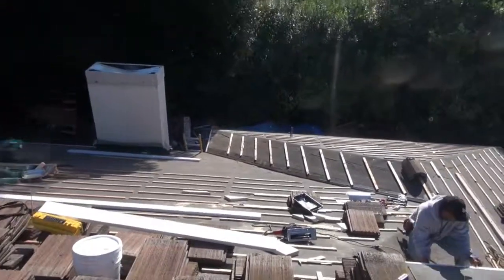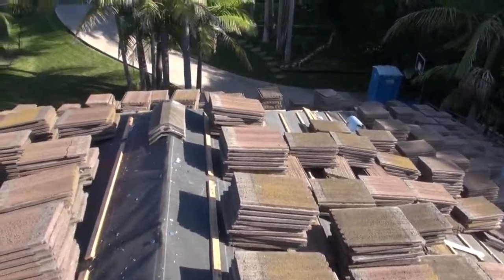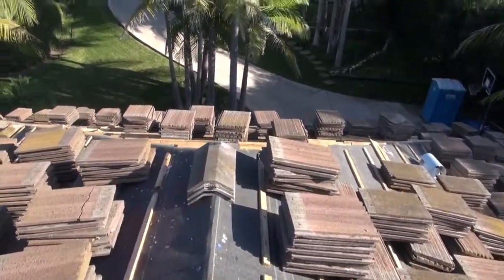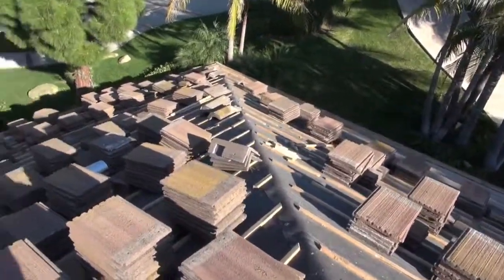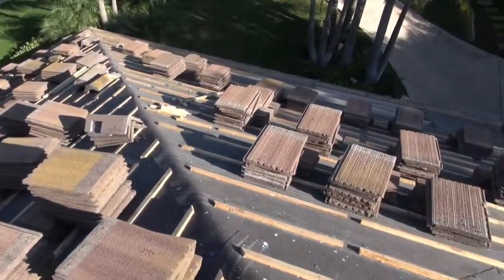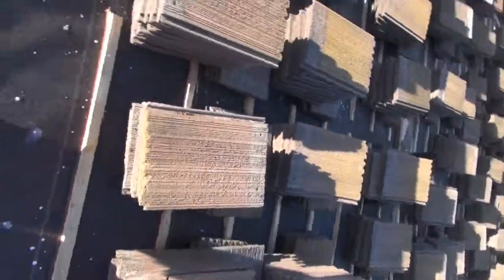As you can see, we got all of our batten strips installed. There's a lot of them. Tiles are approximately 17 inches long — you need a three-inch headlap, or three inches of coverage. So tiles are going to have to be marked at 14 inches, or 13 and a half, whatever is better. Let's see what we mark this at.